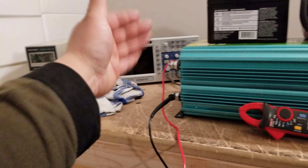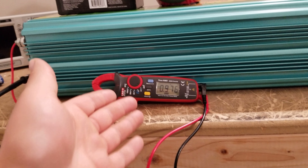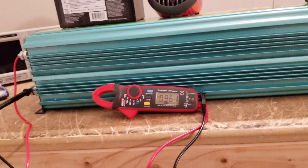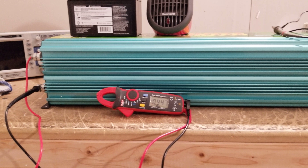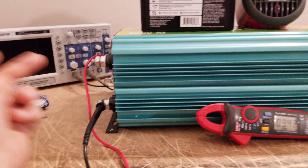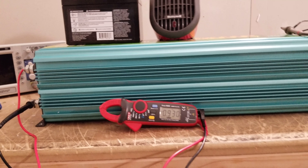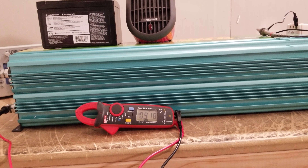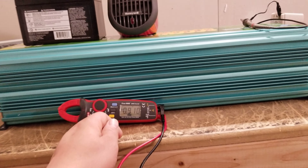For me personally, I use a power supply to charge the caps first. I can hook the power supply up to the terminals, charge them up, disconnect it — they stay charged as I demonstrated — then I can hook my batteries up and get no spark at all. You can also use an incandescent bulb run between the posts and the battery bank, and that will slowly charge the caps. Usually takes about 30 minutes and that'll avoid the spark.